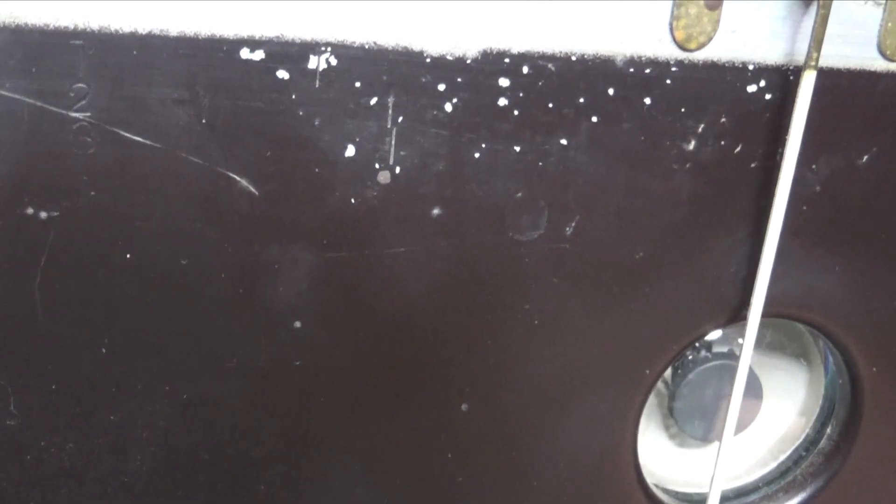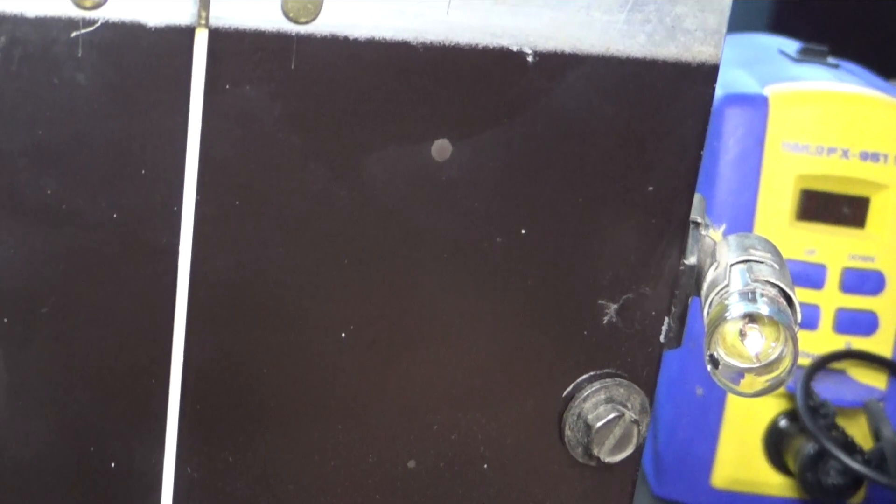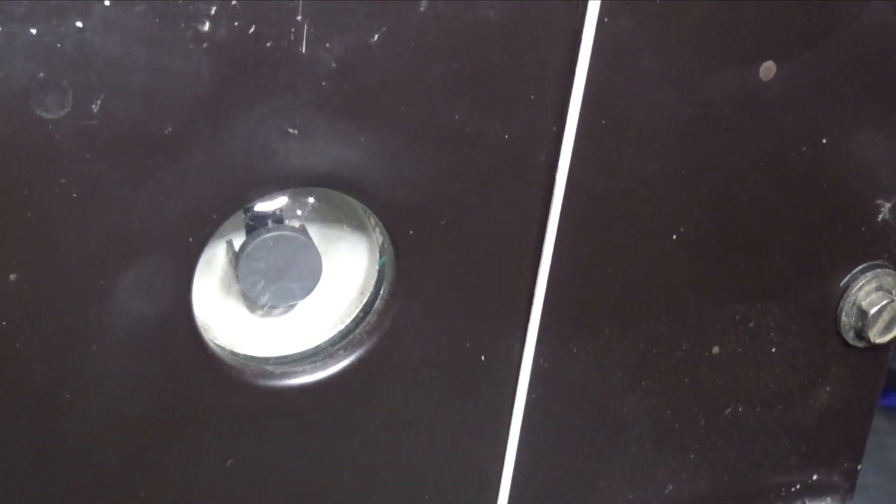The 600 mark is this line right here — there's 600. Then coming down here, that line right there is 1500 kilocycles. So that's how you know where to set things — really cool. If you have a radio without a dial glass, you'll know to look at the plate markings. In the next episode the radio will be fully aligned and ready to go, and we'll look at ways to improve and make it better. Everybody have a great day!